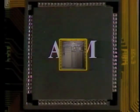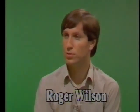Inside this innocent-looking piece of black plastic is the first of a new breed of silicon computer — that's RISC, or Reduced Instruction Set Computer. I've been joined by Roger Wilson, who helped design the chip in the first place. Roger, I know that RISC stands for Reduced Instruction Set Computer, but reduced compared to what? It's been reduced compared with a conventional instruction set computer like the Motorola 68000, which you'll find in many machines nowadays. When we look at the instructions that the machine needs to use when executing a program, we find that 80% of the time, just 20% of the instructions are being used. We take away the other ones, and the ones used frequently we optimise, to make the machine run as quickly as possible.